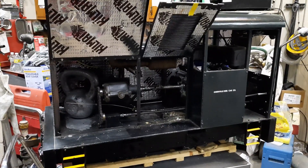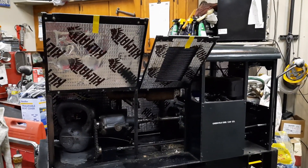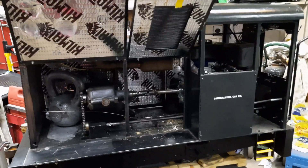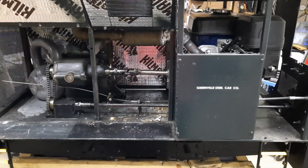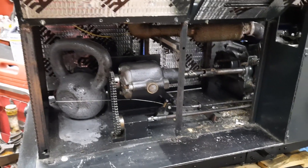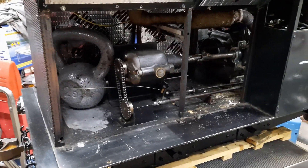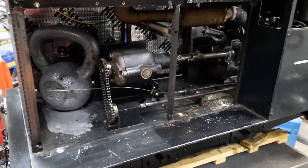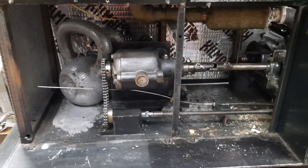Here's a look inside the locomotive with the side panels open. You'll notice this aluminum material along all the inside of the panels — that product is called Kilmat. On the backside of that aluminum there is a tar-based material that is supposed to dampen vibrations and eliminate noise. That material made a very significant difference in making this locomotive quieter. For a little single-cylinder gas mechanical locomotive it's not too bad, but when you go to a rail club and there are folks there with steam engines they've poured countless hours and financial resources into, it does kind of suck to have one of these gas mechanicals sounding like a lawnmower no matter what you do. Hopefully I can eliminate that and stop masking their very nice stack-talking sounds.